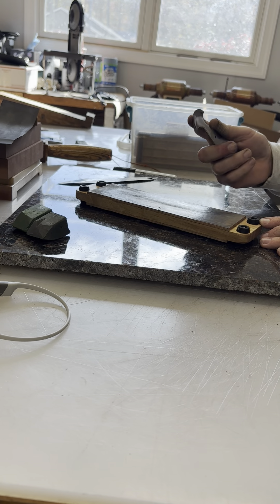Now I have not tested this blade — this one's fresh off the grinder, so I don't know how sharp it is or how it's going to perform. I'm just going to go from the feel of the blade on my thumb. When you're running your hand over it, you don't run it this way — that's going to cut you. You pull it like that, and that's going to allow you to feel it. It grabs the ridges of your fingerprints a little bit more, and you can tell the difference. Let's go to our cutting table. That is through eight ounce bridle like a laser beam. So that's sharp.